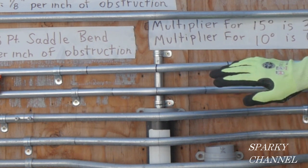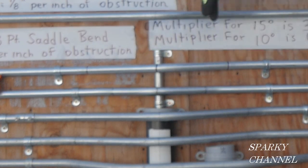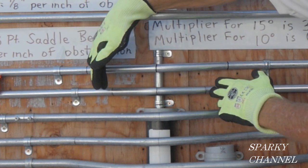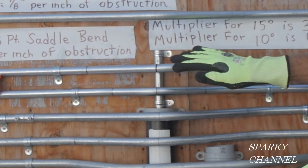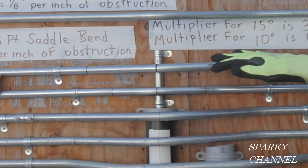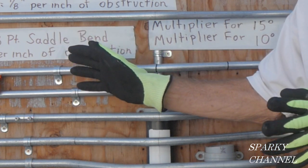The difference when choosing what angles to use — a 10/20/10 takes more room, while the 15/30/15 doesn't take as much room. That might make a difference. If you do have the room, use the smaller angles because when you run your wire there's going to be less resistance. You'll hardly even notice the 10/20/10 when you're running your wire — it'll just go right through. No problem.